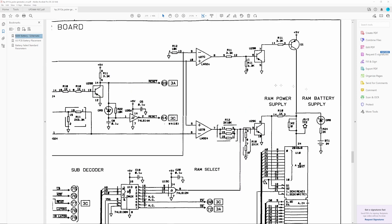Looking at the HP 8112 schematic, the battery is listed as 3 volts. In the event of the power supply switching off, the RAM is powered via the backup battery through a circuit with a current-limiting resistor and a Schottky diode. To me, that offers no capability for recharging the NiCad battery, and the NiCad cell voltage is too low for data retention.